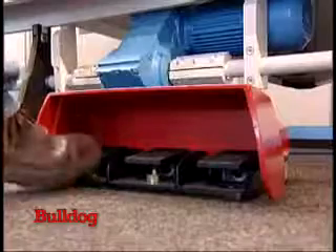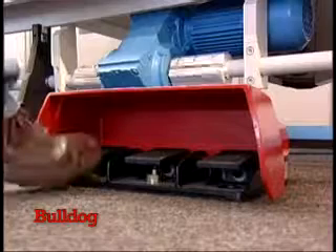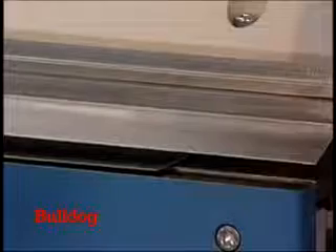The material is clamped by an upper beam with spindle drive, operated by a movable foot switch. The speed of the roller ball spindle is very impressive — at fast speed mode the spindle moves 20 mm per second. For safety reasons, the upper beam stops at 8 mm. To close the upper beam completely, press the foot switch again.